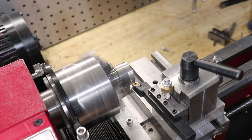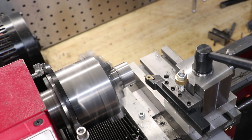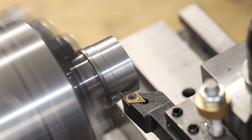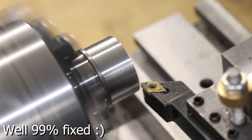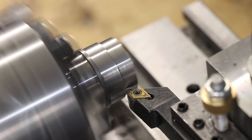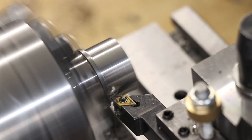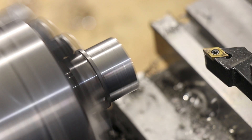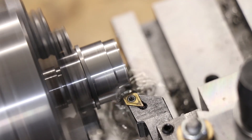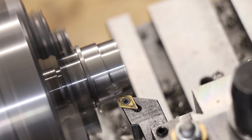I'll start off with a 0.25mm depth of cut in steel. Initially I couldn't feel too much improvement on such a light cut, but the real improvement was on the back pass — usually there's a bit of material that gets removed, but here there wasn't any, which is usually a sign of things flexing slightly under load. That's definitely a big improvement. Next I'll ramp up the cuts — I'm currently doing a 1mm depth of cut. A 1mm depth of cut used to be the absolute limit for this lathe and I could always feel the deflection and resonance, but now a lot of it has been reduced. Finally I'll push the lathe to its limit: the old max was 1mm, but currently I'm doing 1.25mm and it's handling it really well. Anything more and I'm just going to stall the motor, so that is the limiting factor now — not the rigidity.